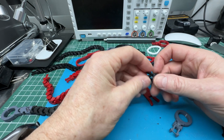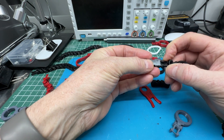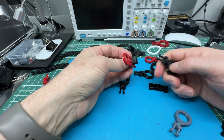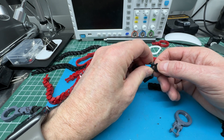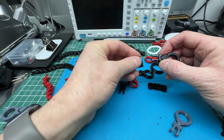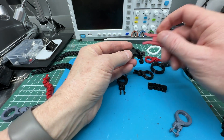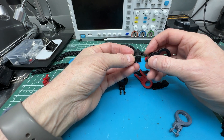I'm a little concerned with how this will perform in PLA. The issue is that when you flex the barbs to go into the female side of the connector, they bend pretty hard, and it's important they flex back out and lock in place. I haven't printed it in PLA, so I'm concerned the material memory won't be sufficient to allow that flex-back. If that's the case, the solution is a longer version of the connector which gives more room for flex. I can post that too — it's not as pretty because the joints are more visible, but if it's needed it'll be there.